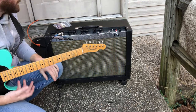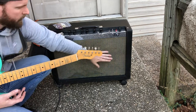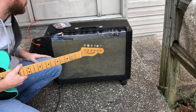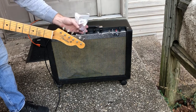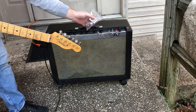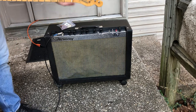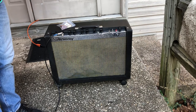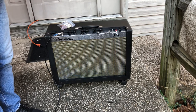Unlike the rest of the Harmony amps, this one has a lot of volume. It has the original 2x12 Jensens. The grille cloth looks like it might have gotten close to a chalk line — it had blue chalk and I tried to get it out as much as possible, it has been cleaned. The bypass caps — those old molded capacitors — have been changed out; a couple of the good ones were left because they tested fine. The death cap was removed when I grounded it properly. It had a tag indicating it was serviced in '93 but I really didn't see any evidence of service being done.